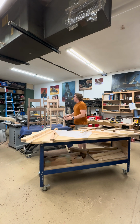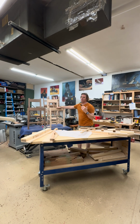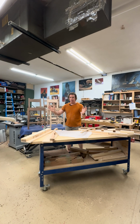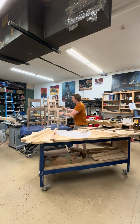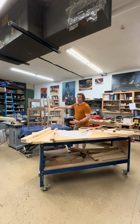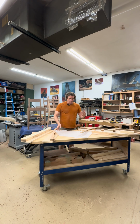So I really like Chippendale through joinery, straight mortises in the back and the front with angled tenons for the side rails and the stretchers. It just makes it difficult. And since I wanted through mortises, through mortise wedge tenons on all of my joints mostly, it makes it even harder. So I was busy doing the smaller stools, trying to get those wrapped up into market.